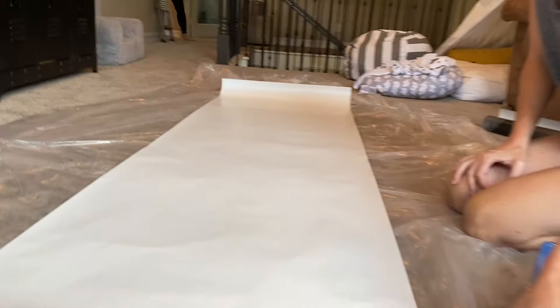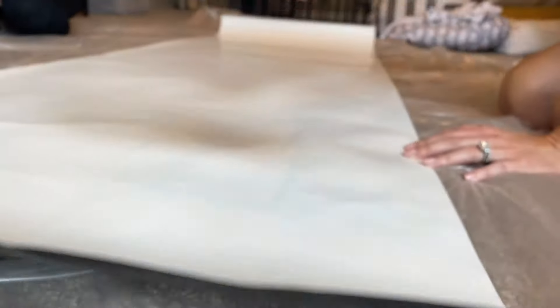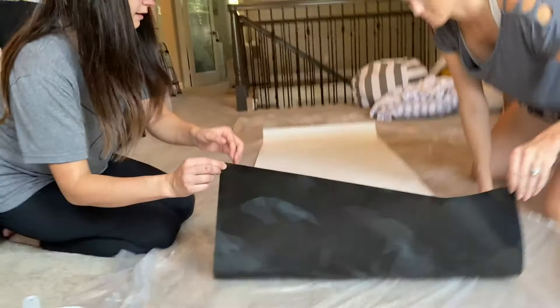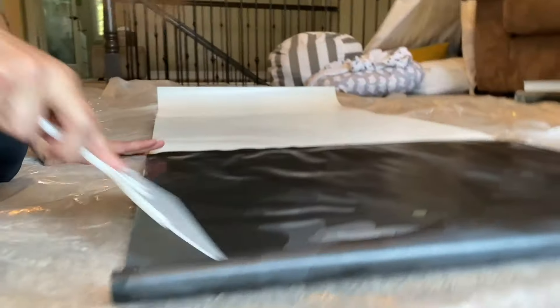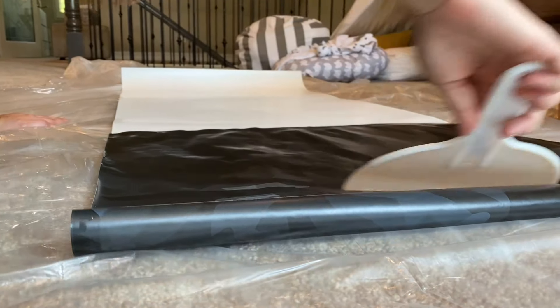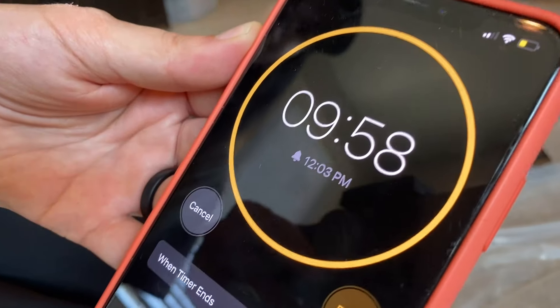Lay a piece of plastic down to protect your floors. It's just water that we're working with, but since we're activating the adhesive you want to make sure that your floors are protected from the water and the adhesive. Then find the first piece of wallpaper — A New Wall labels each piece with a number in the upper left-hand corner. Make sure you pay attention to what side is the top and the bottom so that you don't hang your mural upside down. Then roll on a generous amount of water to activate the glue, and once you have all your water you're going to fold over your wallpaper onto itself and smooth it out with a plastic scraper. Repeat that process on the other side — if it doesn't line up perfectly straight you can readjust it as much as you need. Then let that set for about 10 minutes and come back and hang it up on the wall.